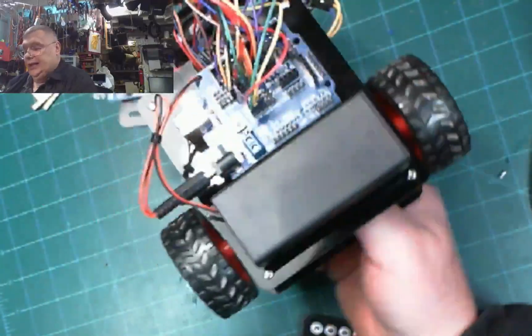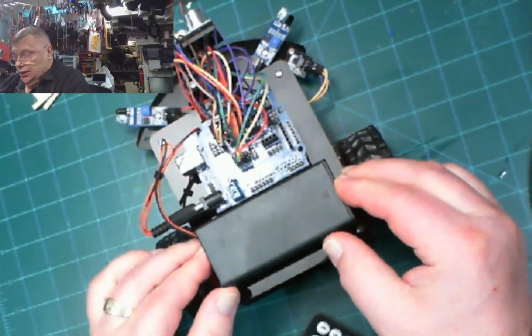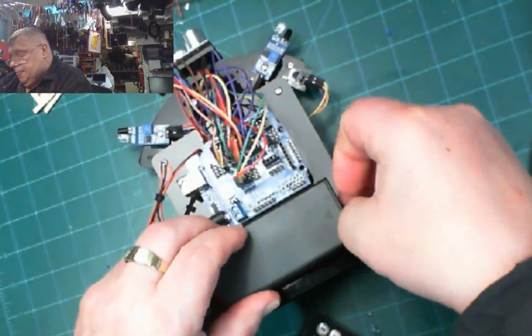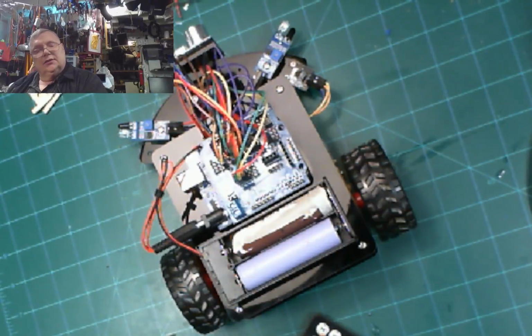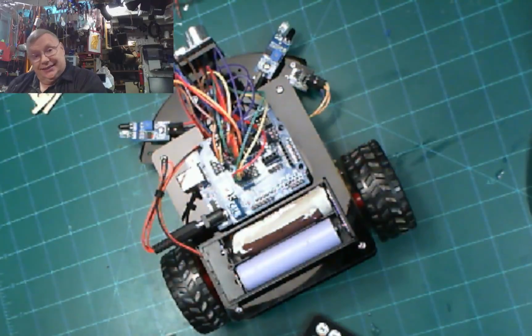This does come with an 18650 battery holder, and it requires 2 18650 batteries. Now, I love these batteries because I take apart old laptop batteries. Okay, as you can see, those are nicely used batteries. And what I do is I carefully, with gloves and eye protection, take the battery apart, the outside, which is this black plastic. Very careful. It's very sharp, by the way, so definitely have gloves and eye protection, and use pliers and knives and whatever it takes to get inside.